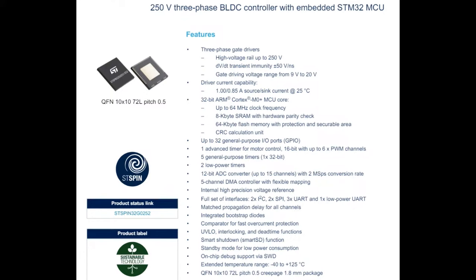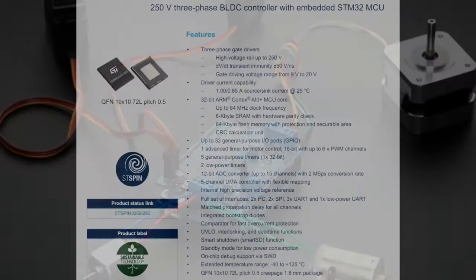And it's built all into one package so that you can have really tight integration with your sensors and your brushless controller. You could have it all in one, and your main microcontroller is also connected to the controller, or you can have this as a peripheral controlled by a more complicated controller, like your main microprocessor, and it can communicate over I2C, SPI, UART. All the timing, temperature monitoring, power control, and whatever your complex motor control can all run on a dedicated core, but at a low price.